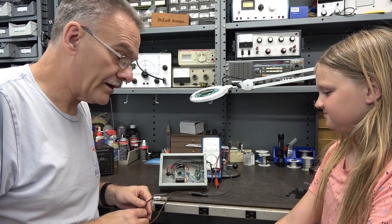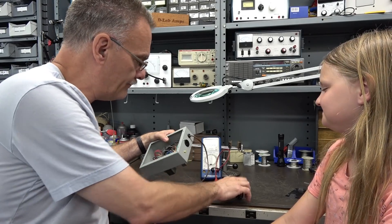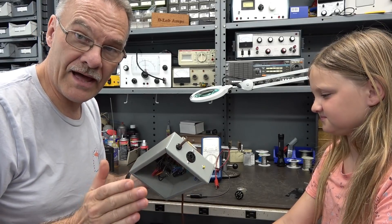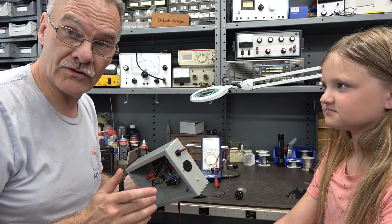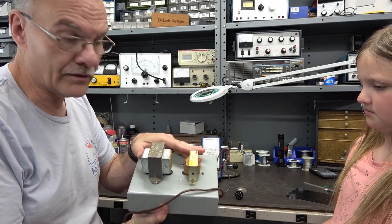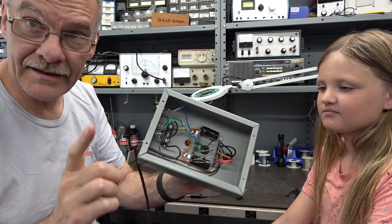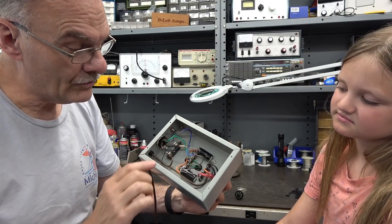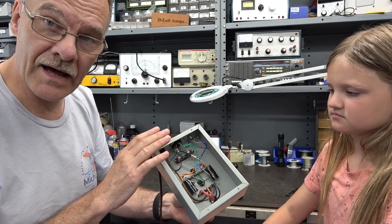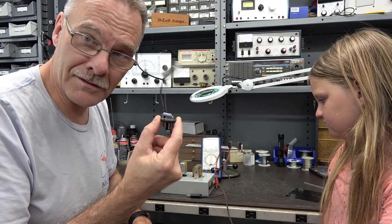The power box is all wired up. Getting ready to check it out — remember this is going to plug into that Heathkit preamp, which I don't have, but I believe the owner is actually going to send one out to me. On top you have the power transformer and choke. On the bottom side it's point-to-point wired. I did add a 10k resistor which is not currently on my schematic — I did that because the voltage was a little bit too high on the output.